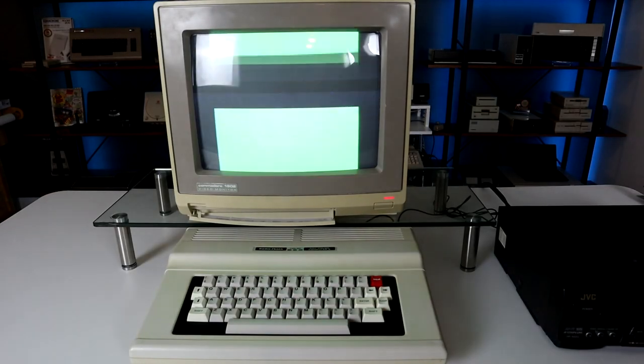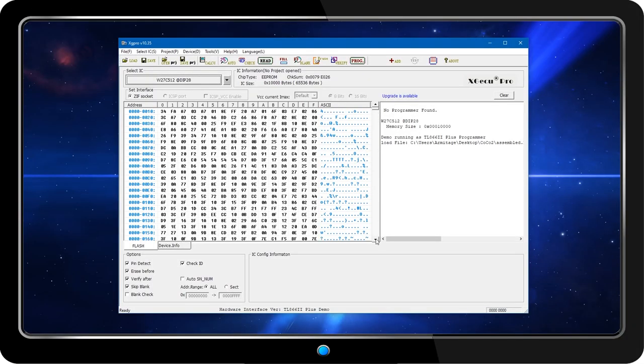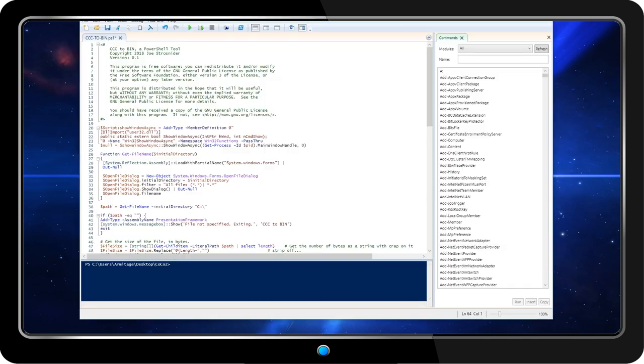So just about every image I tried from three different websites failed to work. I spent about 4 hours checking all my solder joints and continuity, swapping EEPROMs, comparing hex dumps, and converting and burning something like 40 different bin files. Out of all of them, I only got 2 games to work. At least the machine and cartridge seemed to be okay, so it looks like a software problem.